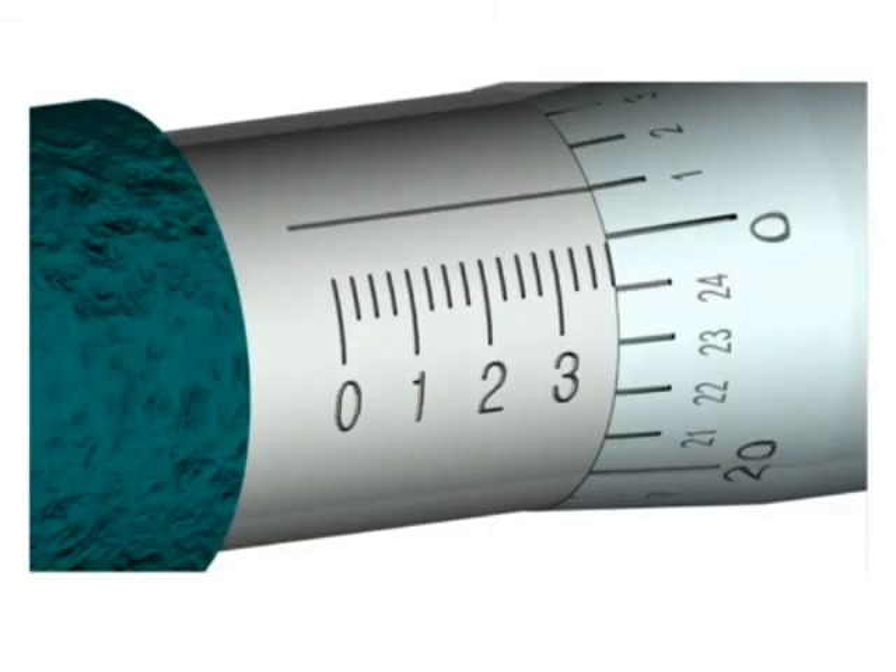On this slide we've gone past the zero mark, so we're working off a brand new mark — it will be a small number since it's new. We've moved from 0.300 to 0.325 to 0.350 to 0.375, and to that we add 0.001. So 375 plus 1 equals 376 — the reading is 0.376.